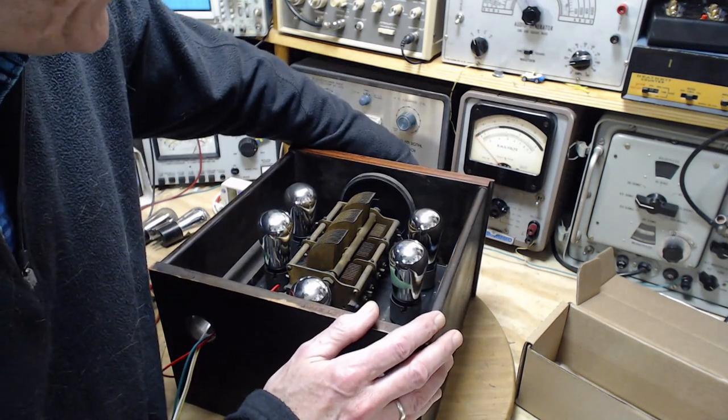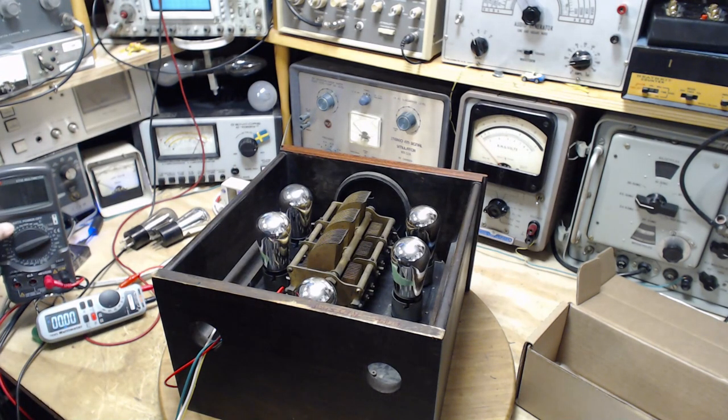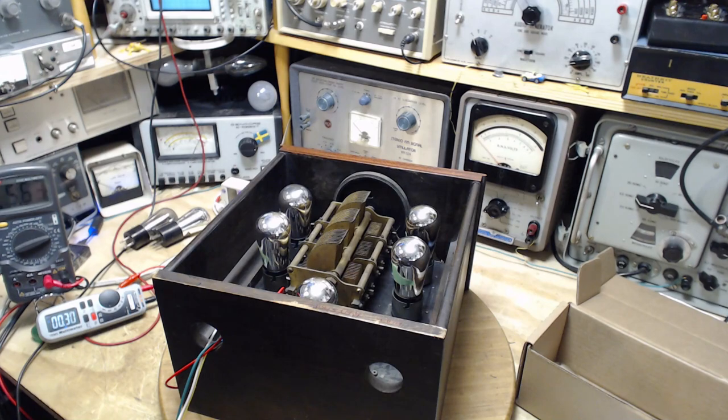The set is off right now. Turn on the supply. We've got 5.6 volts here, no load. Let's turn it on. Not much happens at all — this is 0.1, 0.2 milliamps here. The decimal point is right above my finger there.